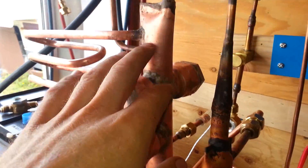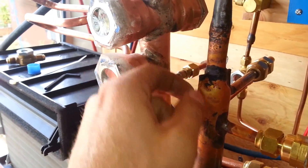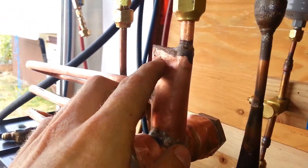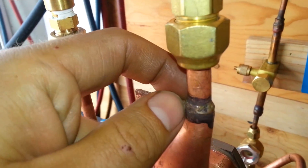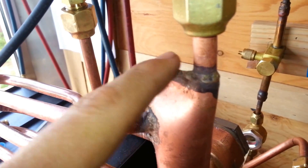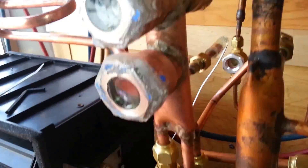Used very similar construction techniques that I have done in the recent past. I have a lot of 1-inch hard drawn copper pipes, so I anneal them at the ends and pinch them in the vise whenever I want to do connections like that. I don't have to use caps — it's actually fewer brazing joints. I like it, it works out pretty well.